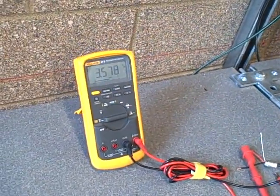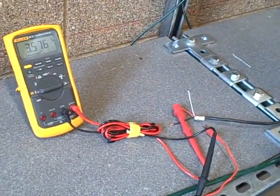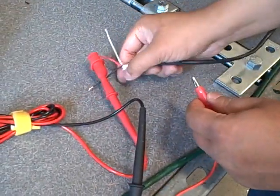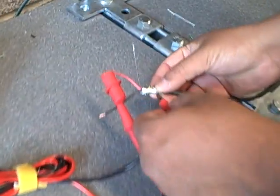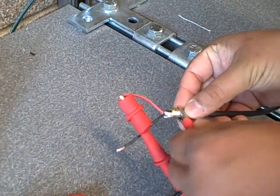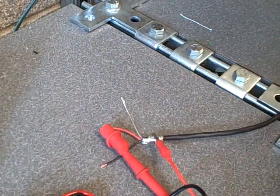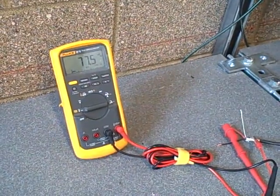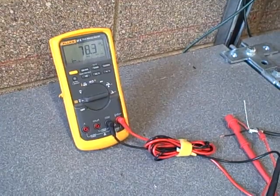How are we going to make that noise voltage go away? In order to reduce this as much as we can, what we're going to do is take and show that we have ground here, and we're going to take the other end of our alligator clips and connect it to the shield of our cable. That's going to bring this back down to very minimal millivolt voltage.